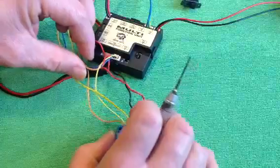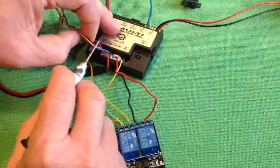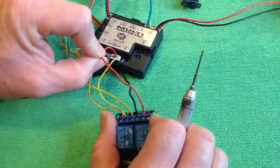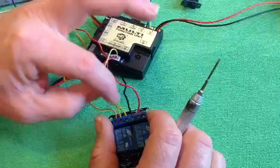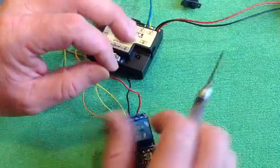If you just run through those basics: this third wire in is your positive supply, so that needs to be split to all three. This second one in is your headlight - that goes to common. And the one closest to the edge of the board is for your machine guns, and likewise that goes to the common pin on your relay. Thank you.